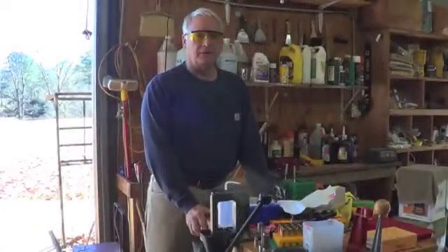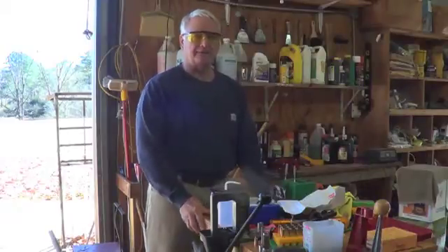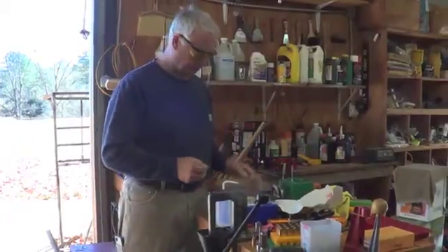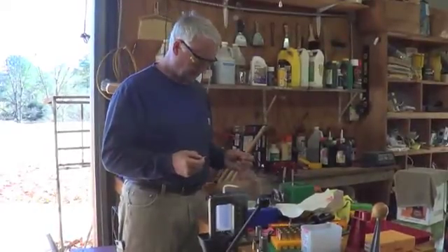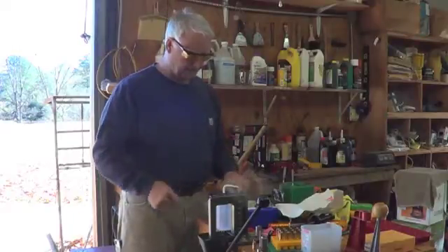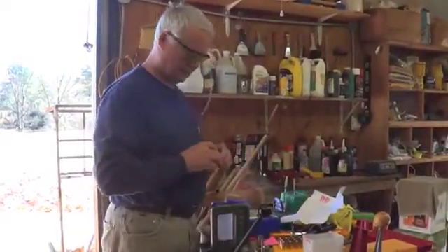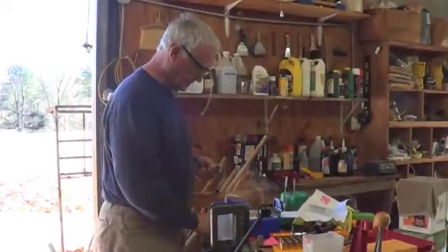Welcome this morning to Race Bottom Productions. From time to time we've made videos and put them on the website. This morning I've been hydroforming some Lapua BR brass, taking it and hydroforming it into Dasher brass. What we're using here is a Hornady fire-form hydroforming die.